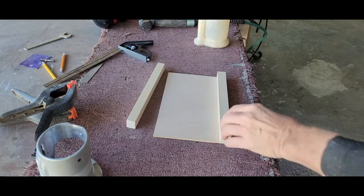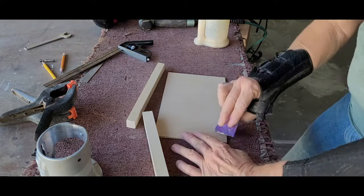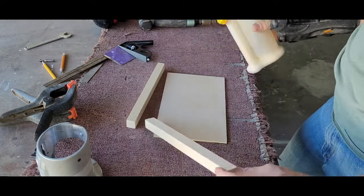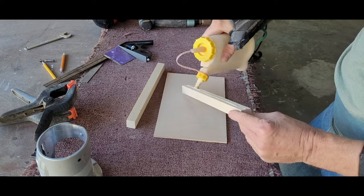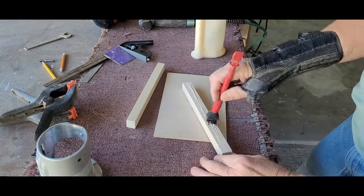It's best to start with a base of ¼ inch material. Here I'm using plywood, but MDF works as well. Your base should be about 2 inches wider than the base of your router, and have enough length to allow for easy clamping. My router base was 4 1⁄8 inches round, so I started with a piece that was roughly 6 inches by 10 inches.